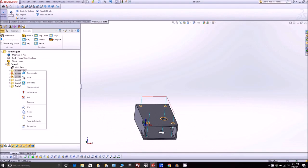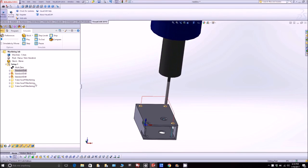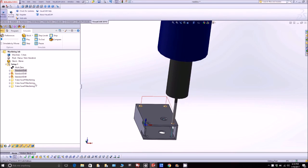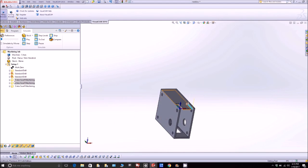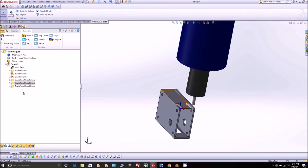Back to Monday when I was in the shop on my own — after finishing off the door frame, I decided to start working on some tool paths for the lock boxes. These are the ones I came up with: drilling the various different holes in the large lock boxes, and then doing a back-and-forth swarf cut to cut out the slot where the actuator goes through the side of the box.